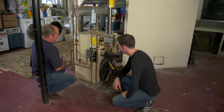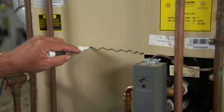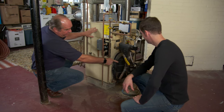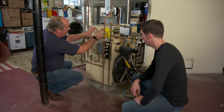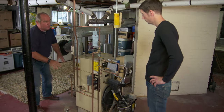Let me take you through how it works. If you could see inside this, it's only half filled with water — imagine a big lobster pot. The thermostat says give me heat upstairs, fires the burner — in your case it's oil-fired — with a flame underneath. The water heats up and all of a sudden turns to steam, fills the top part of the boiler, and moves out through these pipes up to the radiators. Little vents on the radiators will hiss. The steam fills those radiators, the thermostat shuts off, the steam gives off its heat to the room, turns back to water — called condensate — and comes back through the same pipe to the boiler to be reheated.